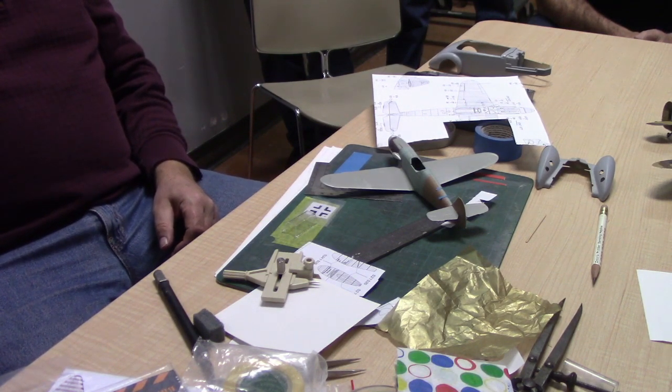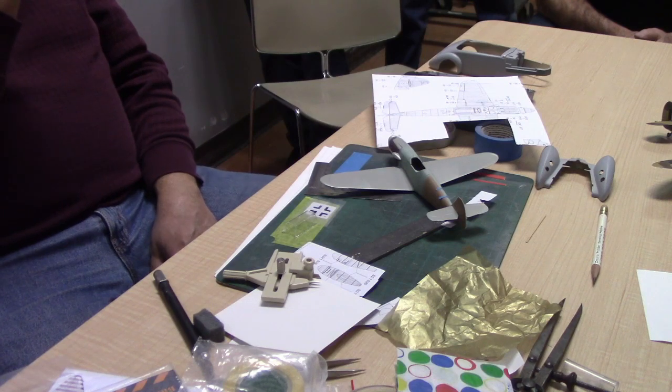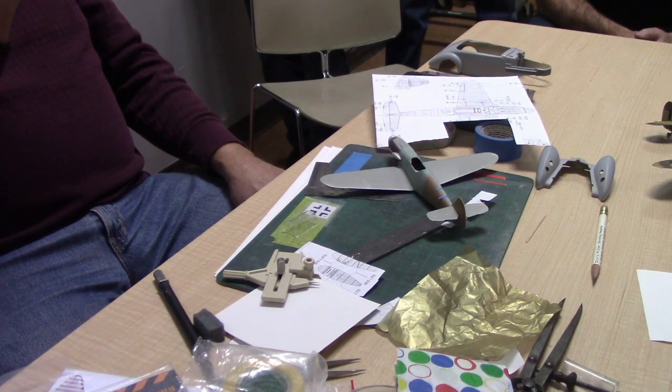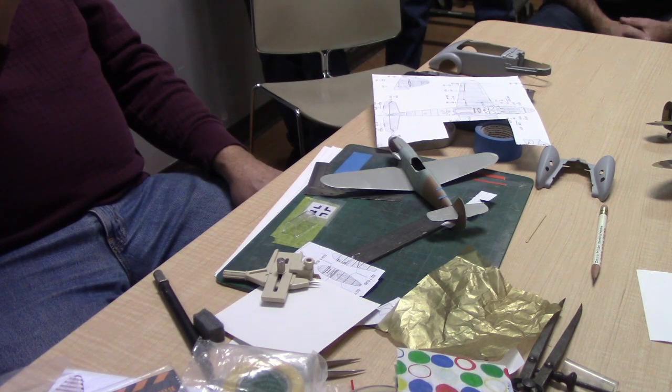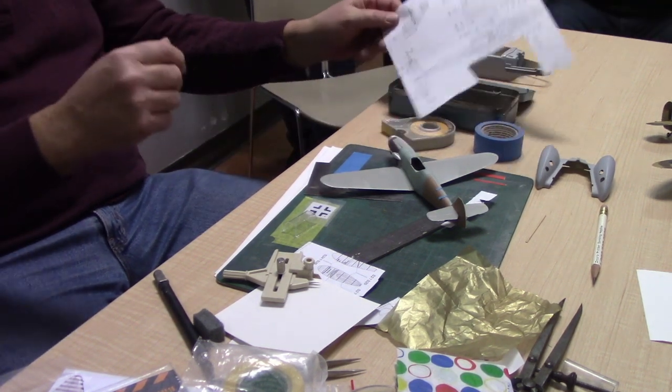Dennis made this punch set back around 1991 and I still use it. The sizes are based on drill bits. You can make your own: take a drill bit, make sure it's decent quality, cut the shank off, and that's your punch. They work amazingly well — nearly 30 years later I'm still using them. You can sharpen them by pushing through the die plate and using a stone on the cutting edge.